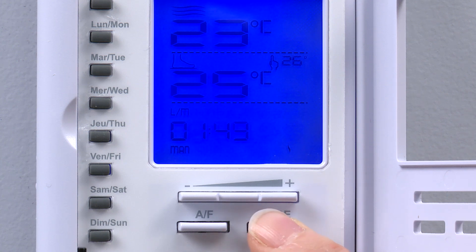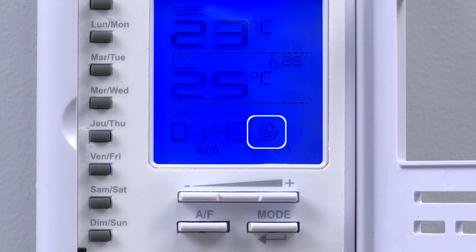Please note that it can take some time for the floor temperature to reach the set point. You can account for this by setting the start of the warming period earlier, for example 30 minutes before your morning wake up time, or by using the anticipated start function on the thermostat.